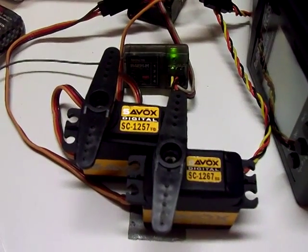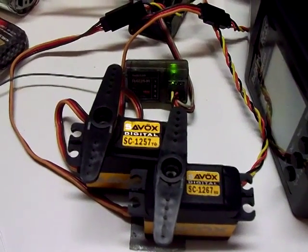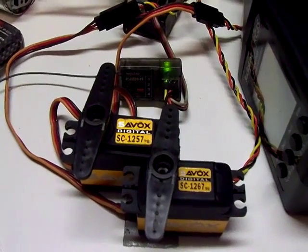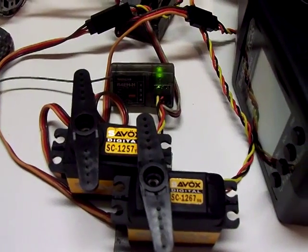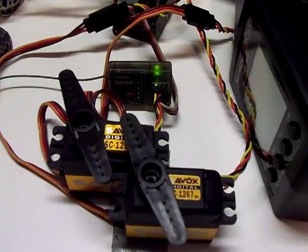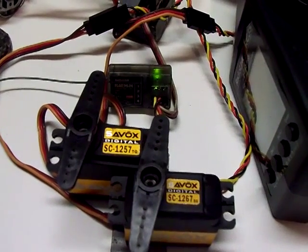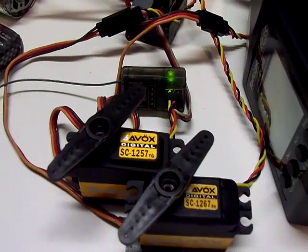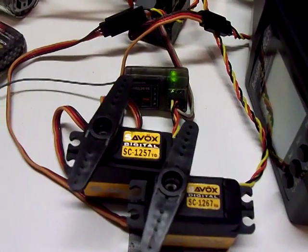The radio is limited to 6-bit, and I was curious to see if the resolution appeared to be the same for both servos, or if the higher bit resolution servo is detectable on video. I'm going to move both servos as slowly as possible to try to see the steps in the resolution. From what I can tell, they both appear to be the same — it doesn't seem like the 12-bit servo is any more precise. It seems to be limited to the 6-bit capability of the radio.